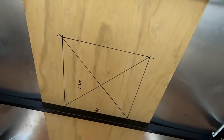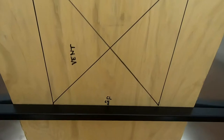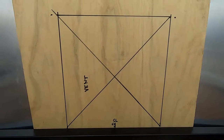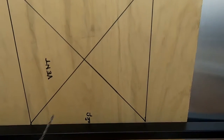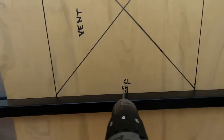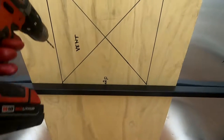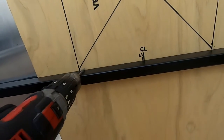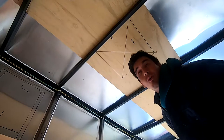I'm going to take my drill with a small drill bit. I've marked out the center line and the area that has to be cut out. The best way to do this is use a jigsaw from the top, but to get the template up on the roof side I need to trace it and have a reference point. So I'll drill a hole starting from the center through the roof, and then probably one on each corner — all four corners or just the edges — so I know where the 14-inch by 14-inch area is to cut. Then I'll take a larger drill bit, drill a bigger hole from the top side, get the jigsaw through it, and start making the cut. Here goes nothing — first hole in the trailer.